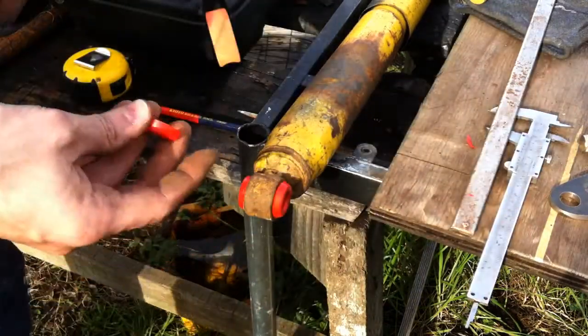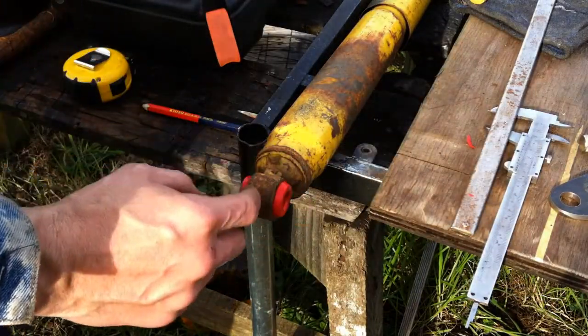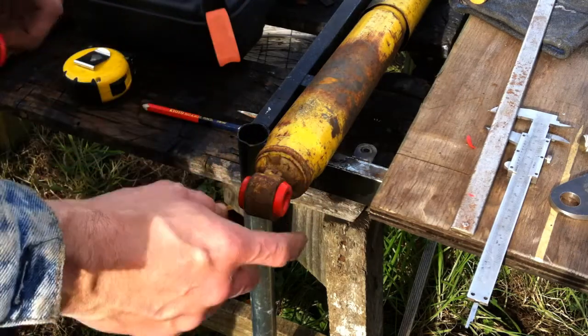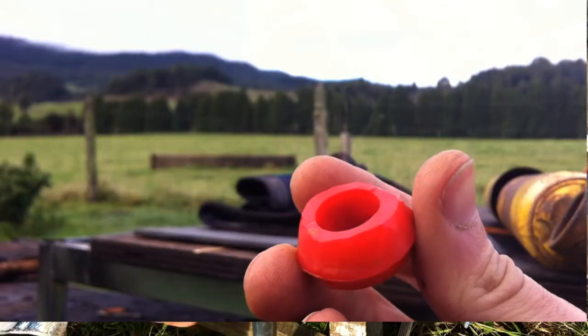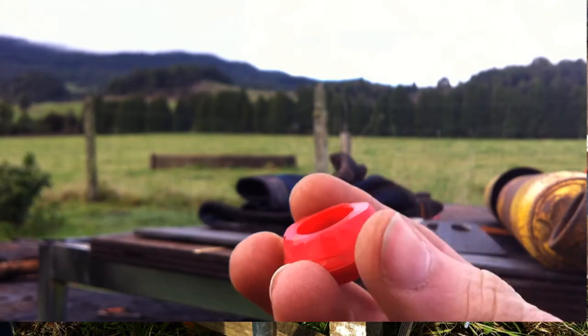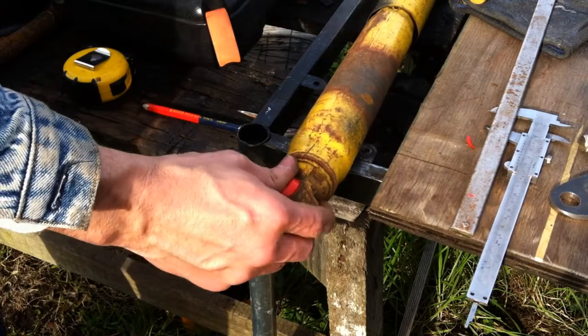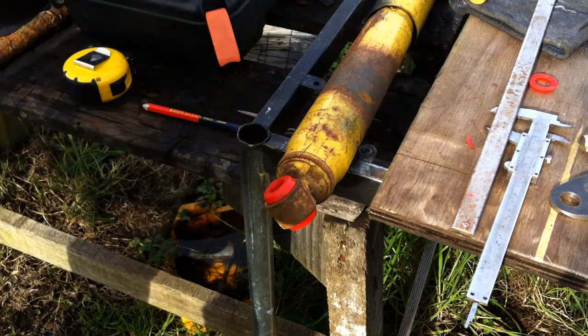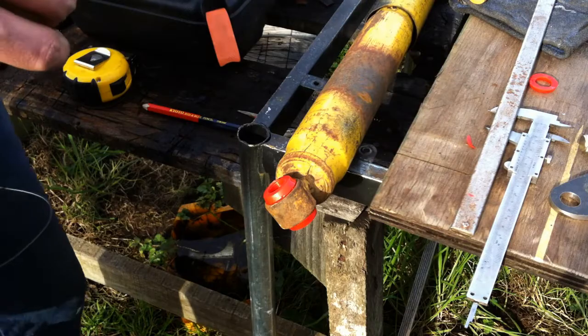In the end, to get the two pieces of this split bushing, I had to cut a little piece off one end and I had to trim it into a bevel on the other end so that it would fit the way that it should. Now I have a nice fitting bushing in there that's nice and tight — it'll fit exactly how I need it to and it'll work perfectly for what I want to do.